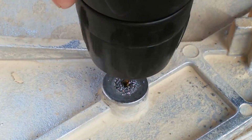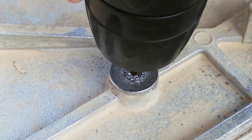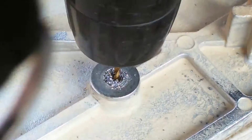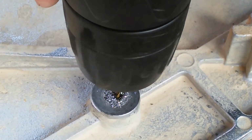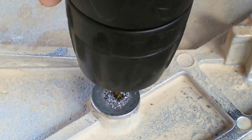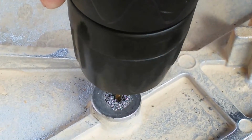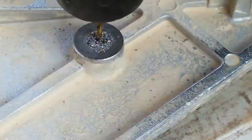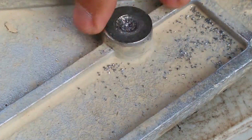The other thing too is that this is a bolt that's actually a hardened steel going into an aluminum piece, so there's a differential of metals there. I doubt that there was anything going on like electrolysis or anything like that, but sometimes that will cause bolts to get stuck, but not as stuck as this one is. This is a pretty simple affair here.